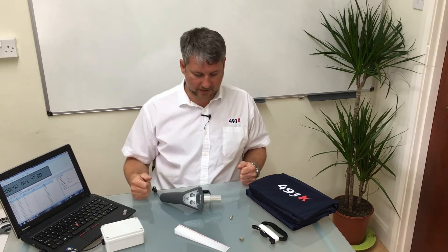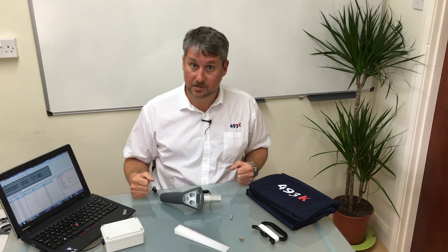It's a thickness tester which is non-destructive, so there's no need to cut parts up or destroy parts. It uses a magnetic induction principle and it is better than a number of the ultrasonic units out there because it doesn't matter what the material you've produced is made of, or the density or the number of layers.